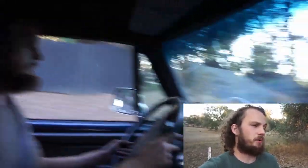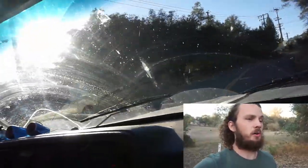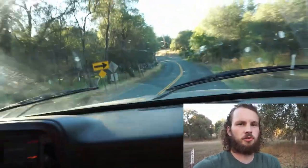So unfortunately, we are only getting about 15 PSI of boost with this turbo, which is right around the same amount of boost that we were achieving before the fuel pin, but now it's just a lot smokier. So we're definitely getting more fuel than we were, but not enough boost to make up for that fuel increase. Diesel should be the other way around, right? You should always have an abundance of air, and it will go as long as it has enough fuel to make it go. Anyways, we assume it's boost leaks. I'm not entirely certain, but I'm mostly certain it's boost leaks.